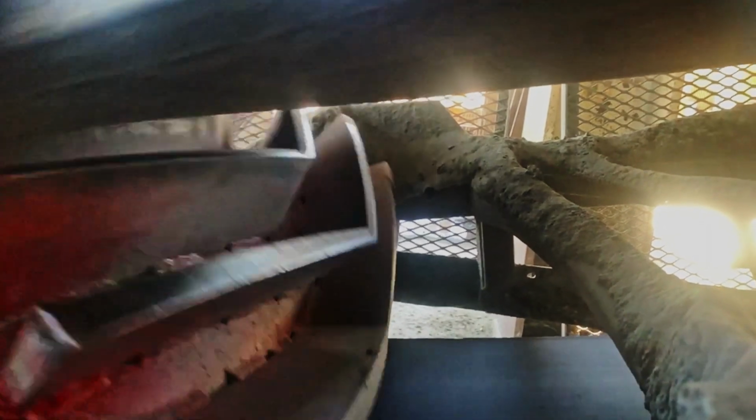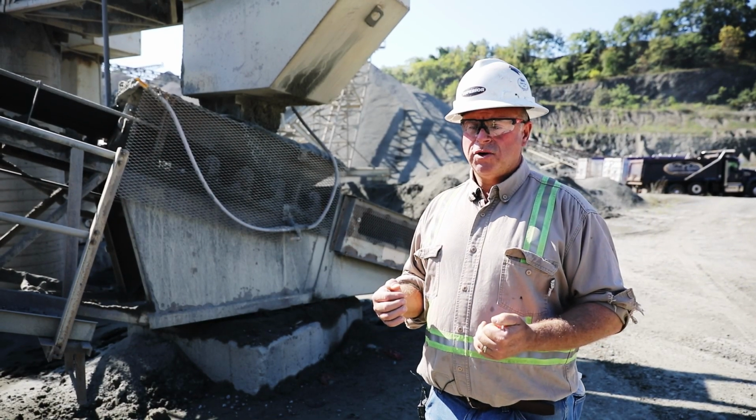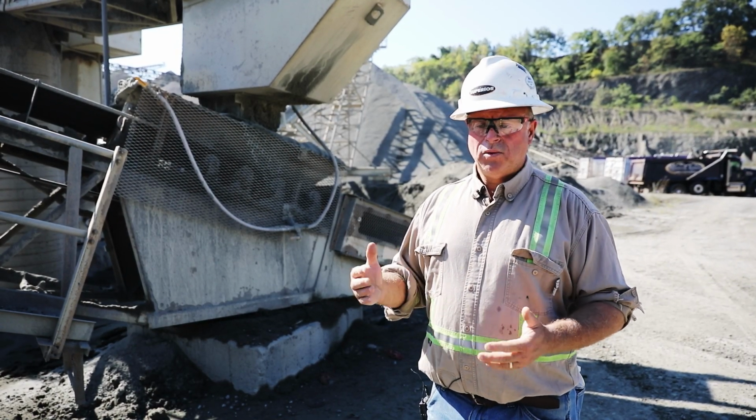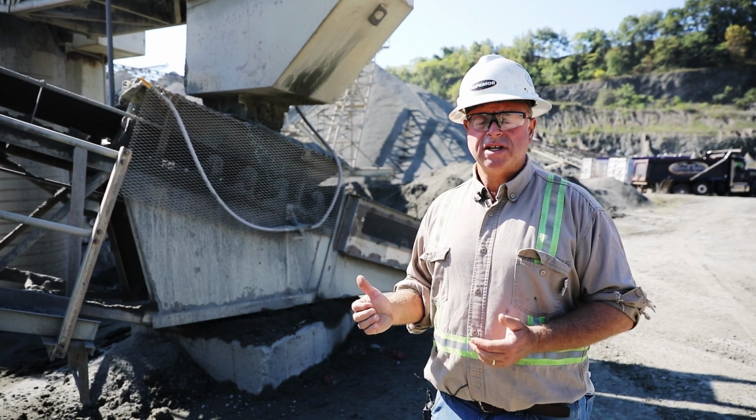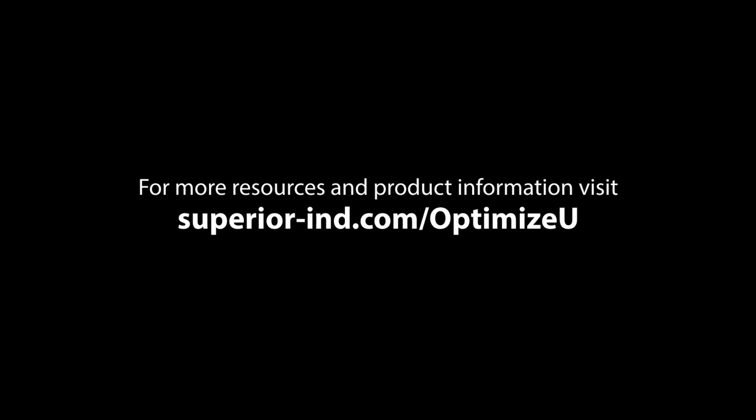With modern guarding requirements, oftentimes there's not room around the tail pulley to discharge material at the tail. So you want to take a look at that when looking at how you're going to clean the belt. Ideally, you want to get everything off before it gets into the tailpiece.